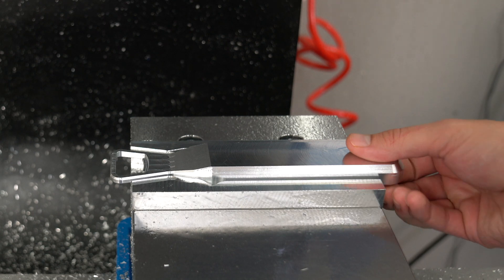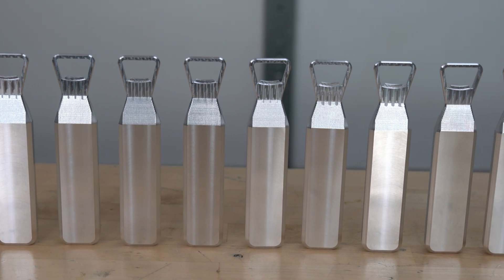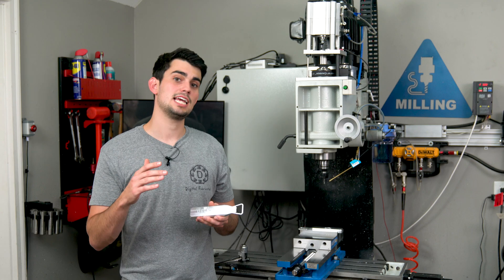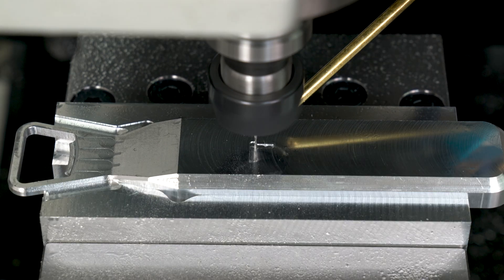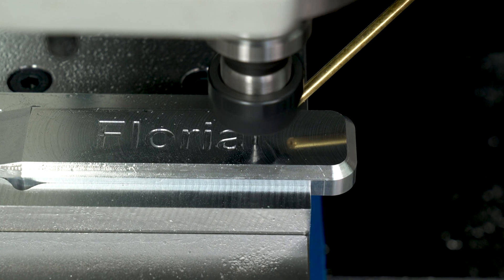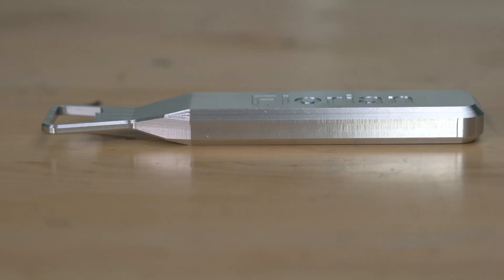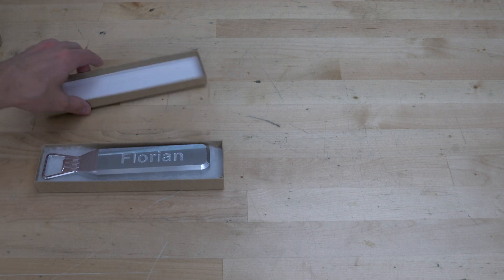This is when I knew I hit the jackpot with this design. It's incredibly smooth, has some weight to it but it's not too heavy, and of course it accomplishes its primary objective — opening bottles. To take this gift the extra step for my groomsmen I went ahead and engraved their last names. A beefy bottle opener like this needs bold block letters. I used a 1mm end mill to engrave the names on both sides, using a 2D adaptive clearing strategy as well as a follow-up 2D contour to get seriously crisp letters. The bottle opener looks great in this machined aluminum finish, but in the future I plan to test out some anodizing and dyeing — perhaps a deep black for the serious drinkers and a light orange or blue for the casuals.